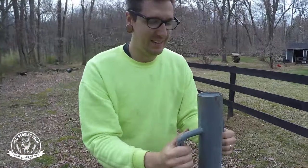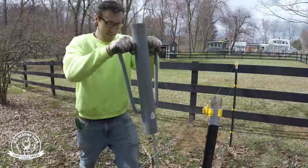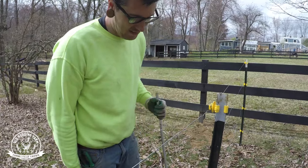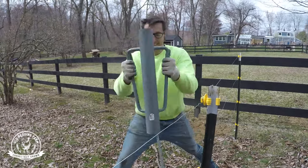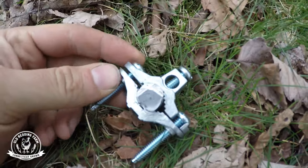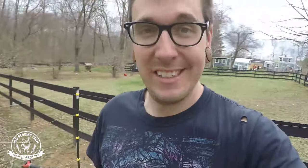So this hasn't moved yet — okay, that's moved. Anybody has a better idea of how to get these into the ground, comment down below. After some difficulty we have gotten our grounding rod in there, and we also have this grounding rod clamp. Next I'm gonna set up where the cutout switch is, and then we're actually getting close to seeing this all done.